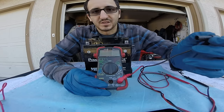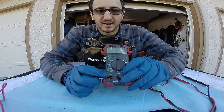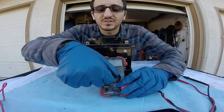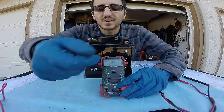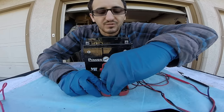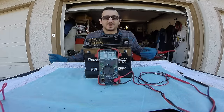Your negative black cable is always going to go in the comm area. This other side is for amperage testing — we'll get to that in another video. You can either go on this side for 12 volts, which would be on this end here, or we could go up to the DC input over here which is a 10 mega ohm input, and that's going to be up to like 20 volts.